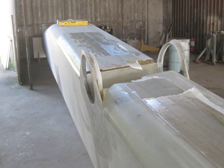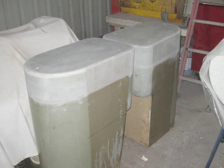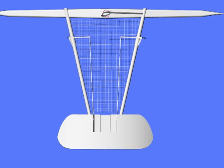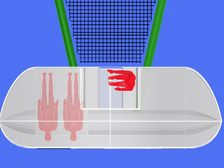The final ready-to-sail weight without the rig will be about 400 kilograms, 880 pounds. The rig will add about another 100 kilograms, 220 pounds. The build cost is $35,000 of which about $10,000 is materials. Painting with water-based paving paint adds another $4,000. The rudders are mounted on the beams and are large enough that the boat does not need daggerboards or keels, which is a significant cost, weight and performance benefit.